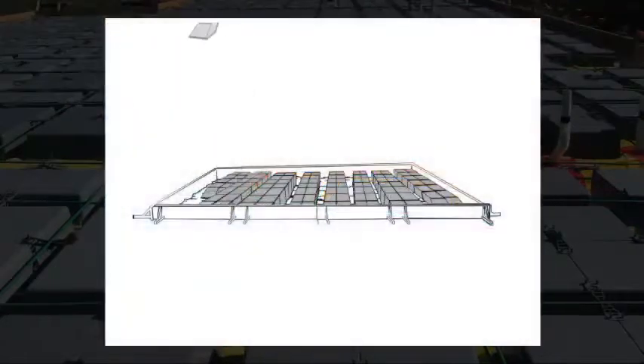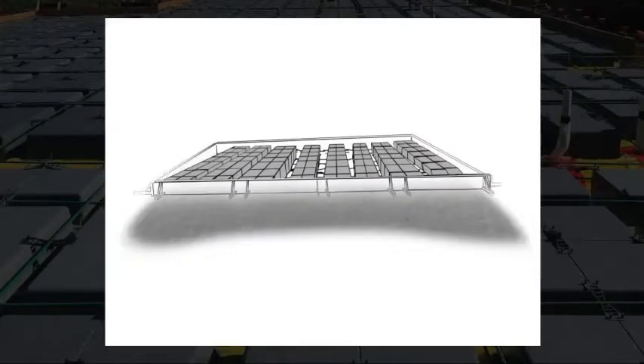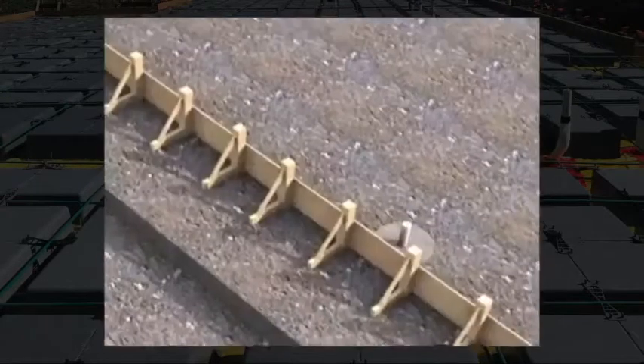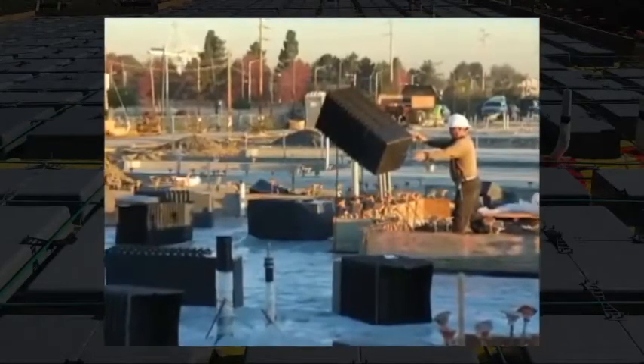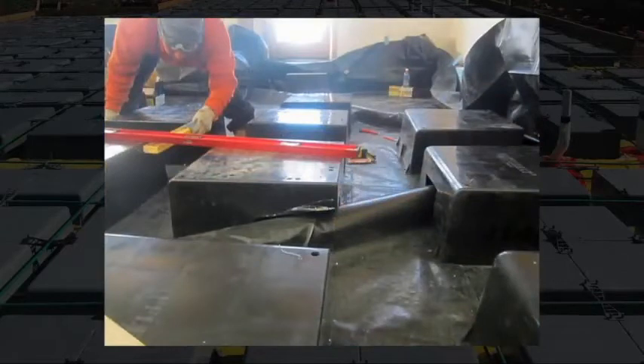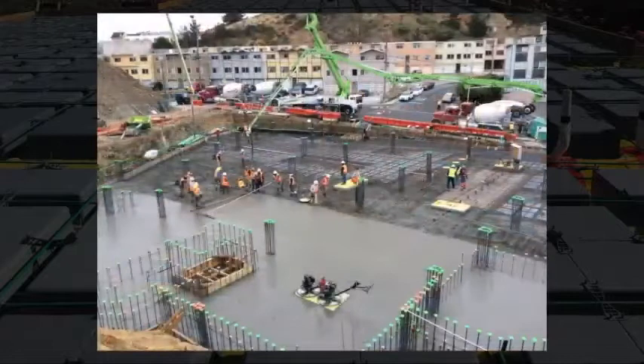The waffle boxes are easily placed and provide a void space for expansion of soils. When installing your new waffle mat foundation on your newly leveled area, you should first use a plastic cover. This will create a barrier, prevent the subsoil from absorbing water from the concrete at the time of casting, make it easier to place the waffle boxes cleanly into position, and avoid the possible transmission of corrosivity of the concrete.